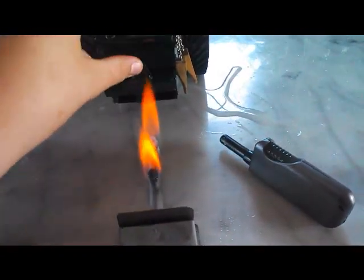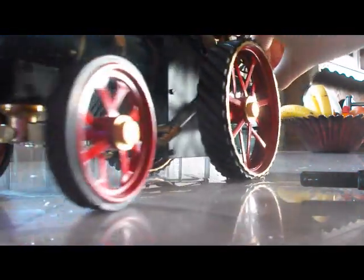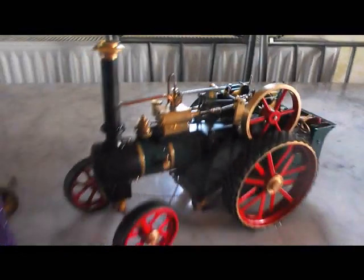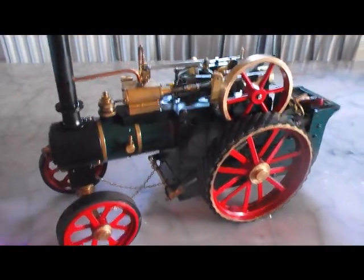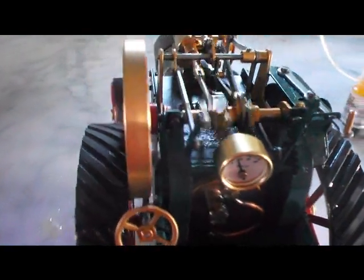Just perfect, now you're lit up, ready to pop it into the boiler. Make sure that this is in the off position, which it is. Now wait until you've got some PSI — roughly about 10 PSI to run. After a few minutes the safety valve will be blowing off very nicely, and you have some pressure in the boiler. It is nearly up to 10 PSI to start — just put the regulator into the full position, give it a turn, and off you go.